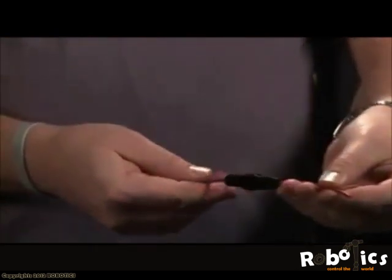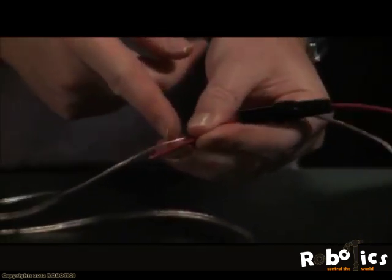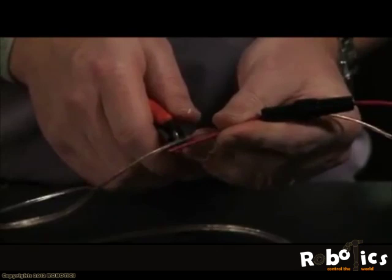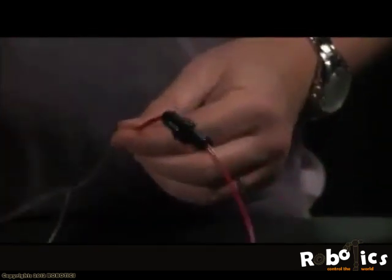Now what you want to do is take the gold strand and lay your fuse wire alongside. Do you know what that length is? Go ahead and cut the gold wire about a half inch short of the full length. This will allow us to insert the fuse assembly onto this wire and then have both ends still be the same length. Okay.